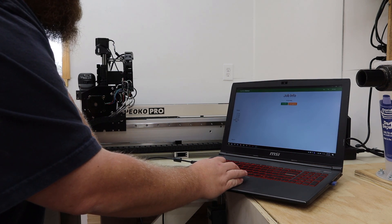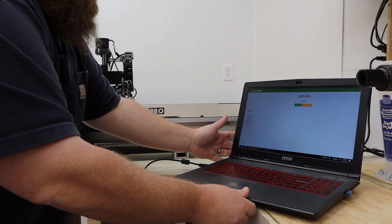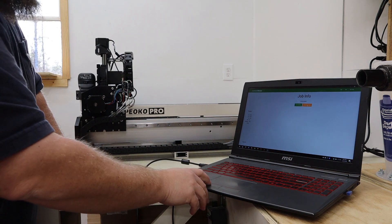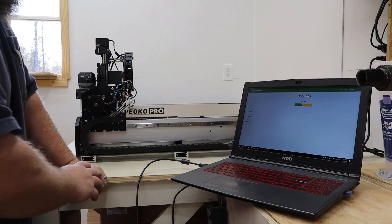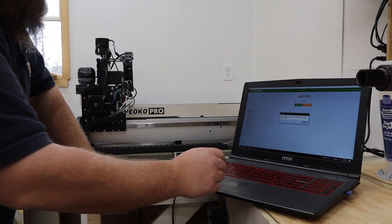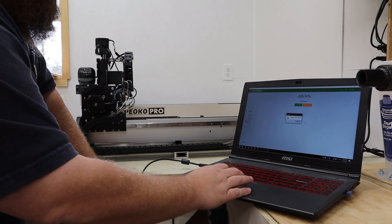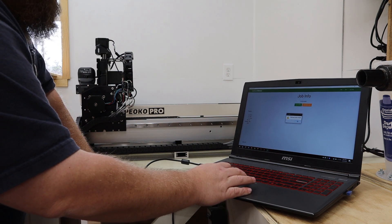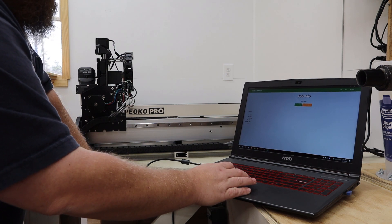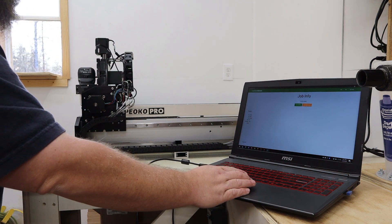Now I'm going to click Initialize and see what happens. I'm going to be very close to this power button — if something goes crazy, I'm going to pull the plug. It says GRBL error: couldn't find homing switch. So I click OK — homing cycle failed. Let's try initializing again. It looks like the Z axis is kind of far down, so we'll try one more time.